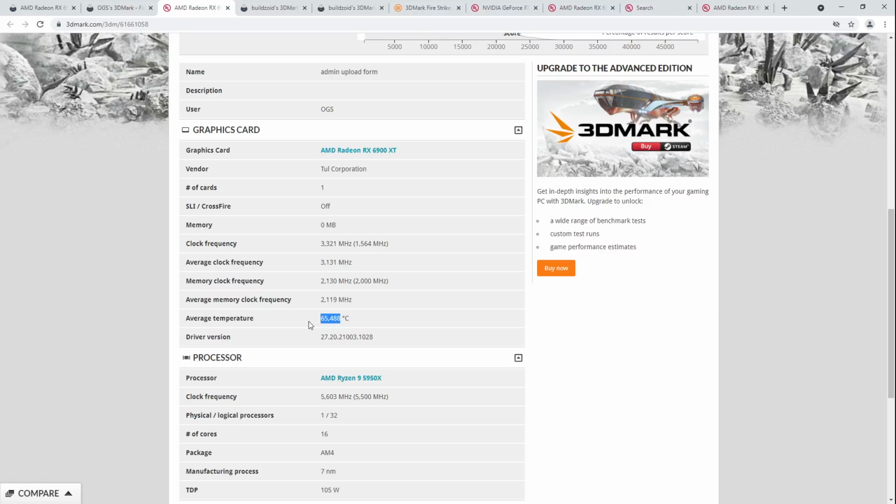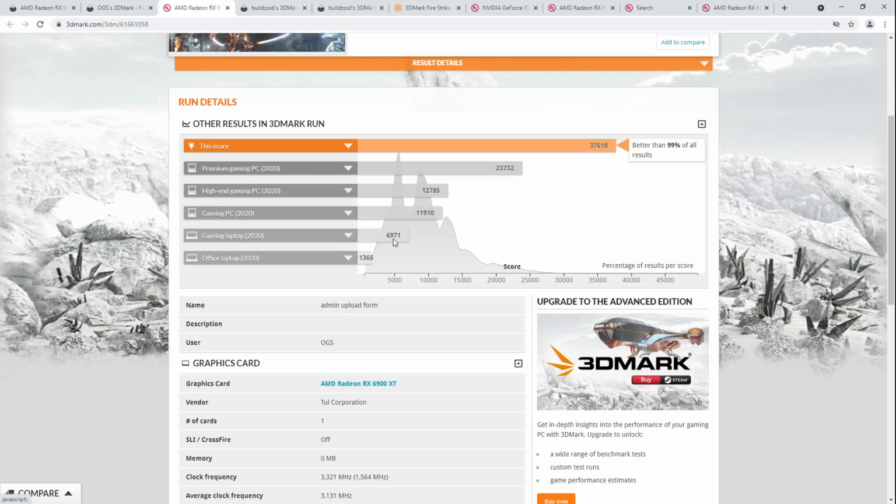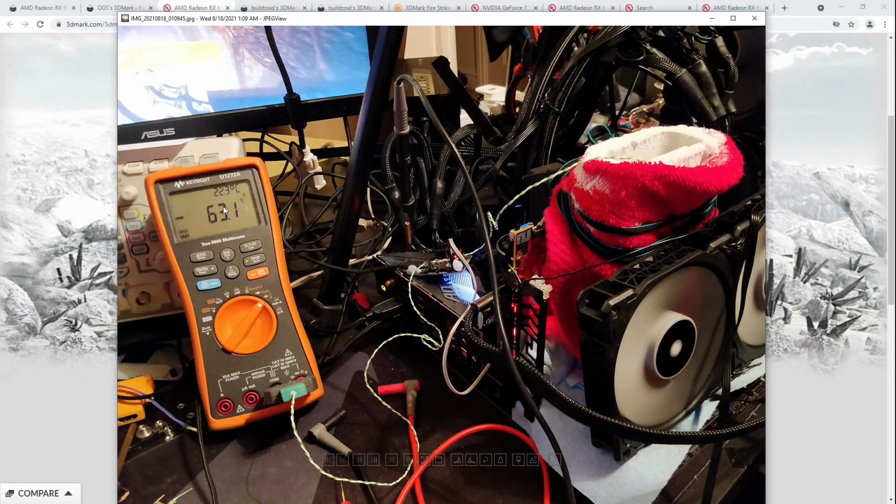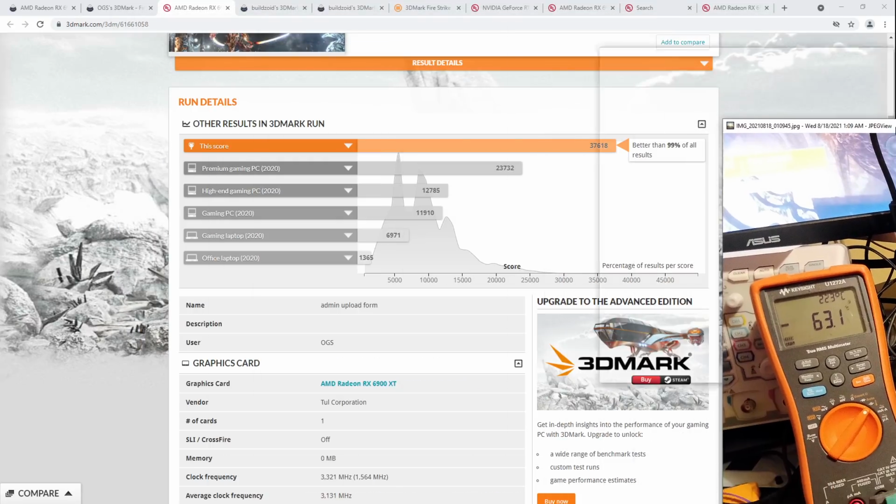I suspect what happens is if you push the temperature too far below, and you can actually push the card below -75 during benchmarks. I'm going by the temperature on the multimeter here, and that multimeter temperature is actually from the LN2 pot, whereas what causes the driver to crash is the die temperature. So you can go below -75 when the GPU is doing something, because it's pulling a bunch of power, and therefore the internal chip temperature is much higher than the LN2 pot temperature, right?